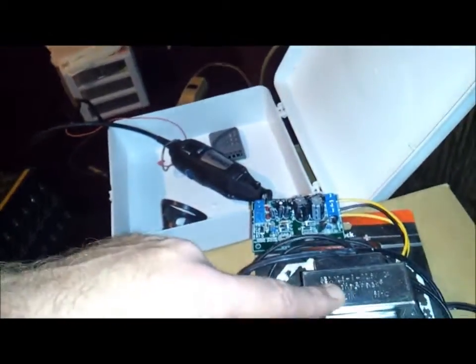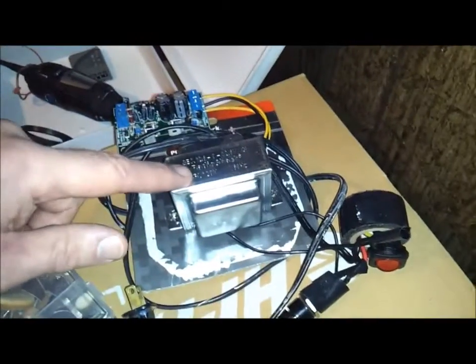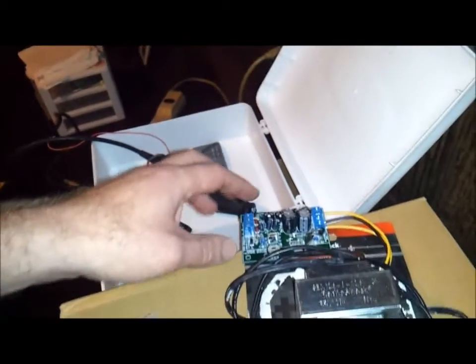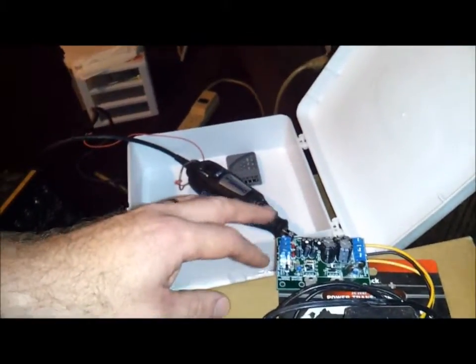I don't know if I connect this to the Soundcraft if it would actually give me enough amperage or if something would burn out, but I had it in my mind that maybe I could try. This is a 12-volt secondary transformer which gives me enough voltage that if I crank this thing up all the way, I can get plus minus 17 volts out of this.